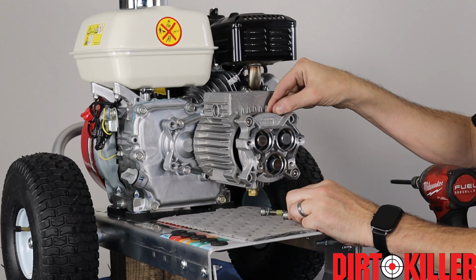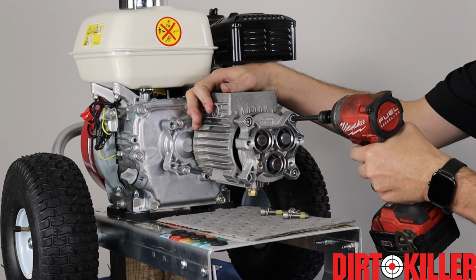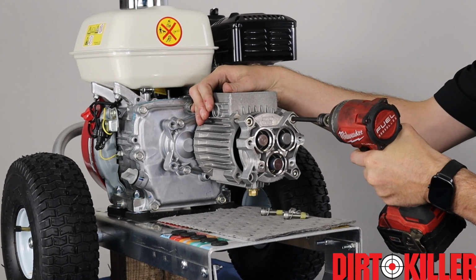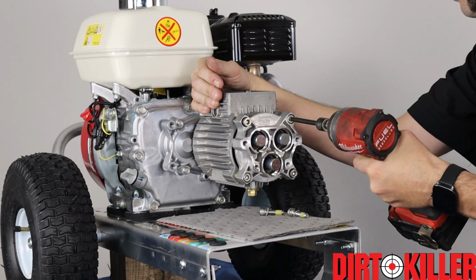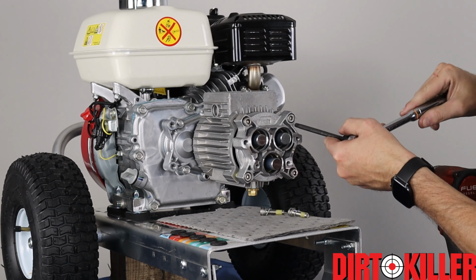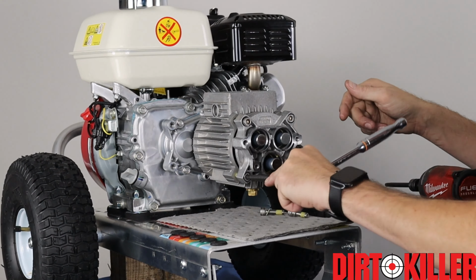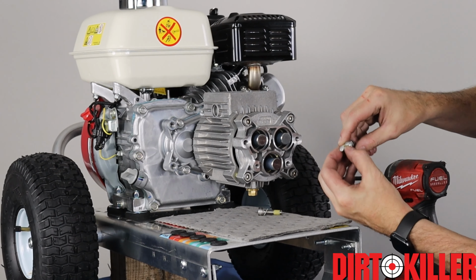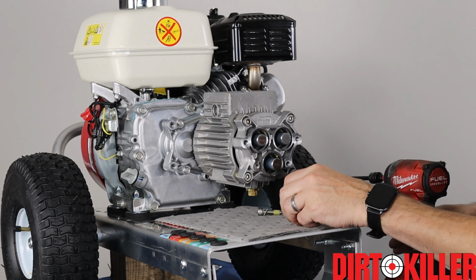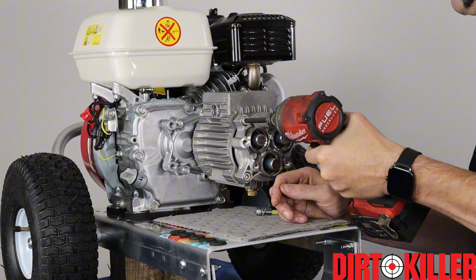So now we have a smaller gap of about 3/4 of an inch. We can get these other bolts started. And we're just going to get it started on that very first thread and then switch corners. For the sake of not cross-threading, check the resistance, make sure that the bolts are going in clean, which they appear to be. Now that we've got about the thickness of the bolt thread actually into the hole, we can take out our other 2 bolts, set them aside for our valve housing, and we'll get this one started.